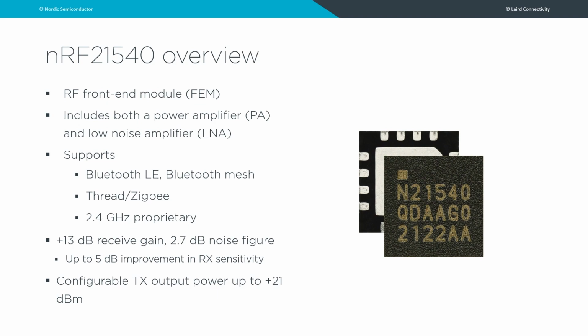So whereas before, if you do have a variation with a 52 series of plus minus 4 dB, customers that, for example, needed 20 dBm would need to set an output power 4 dB lower. So with this control loop, you are basically able to set the output power a lot more granularly than before.